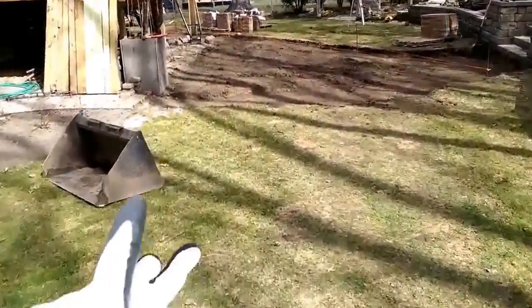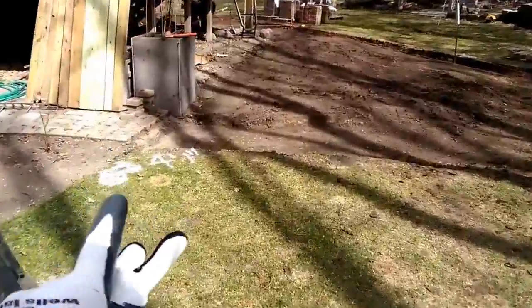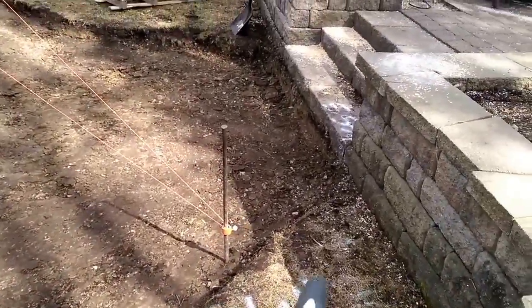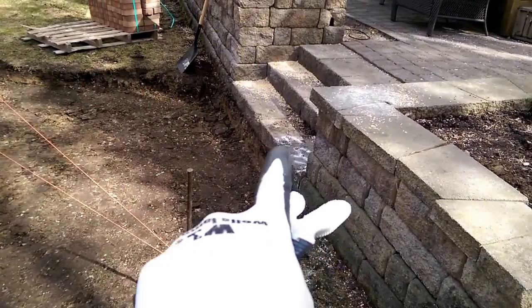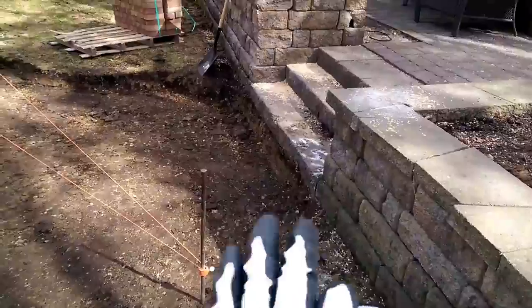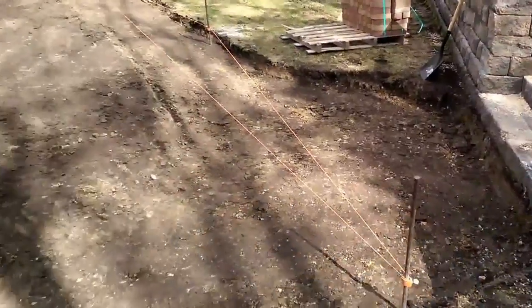And what is happening is this paver height here, we have measurements on at 4.1. And we're going to go over to this knock at 4.4. So it's 3 inches lower, and it's going to patch up to that step. So it's not going to be 3 steps anymore, it's going to be 2. We need more pitch coming this way.